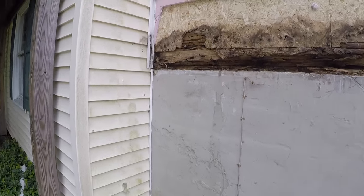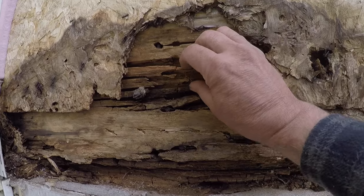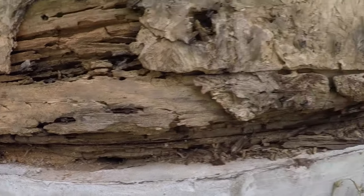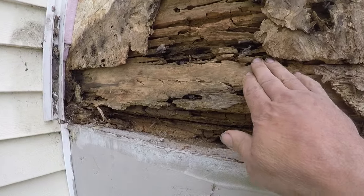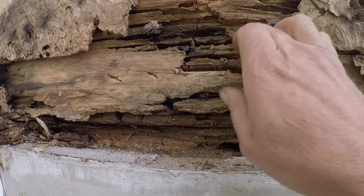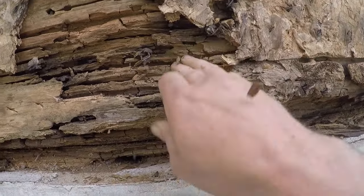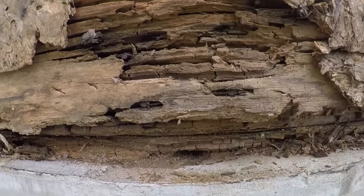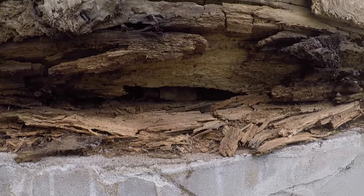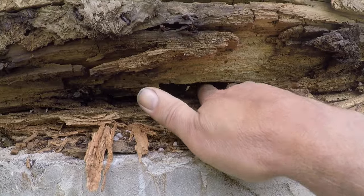What do you do when you see this? The old deck wasn't properly flashed, so we've got some serious rot. It rotted out the rim joists. This is a modular and it's got a double rim. You can see where ants probably went in there, been eating the place up. The outer sheathing is all rotten. Ants will go wherever there's wet wood. The main thing about keeping a house is don't let the wood get wet. You can see where this penetrates all the way back in — I can get back in there to where I can feel the fiberglass insulation.